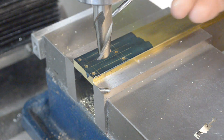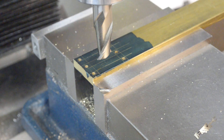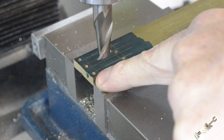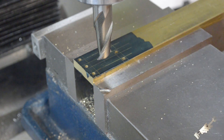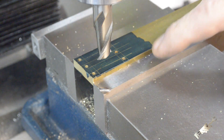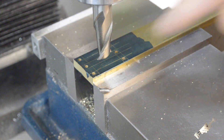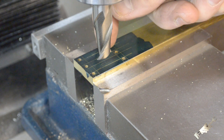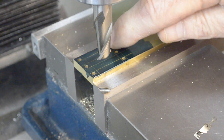I got all the holes drilled. Now I've got a half-inch end mill in here. I came in half an inch — that's going to be a quarter of an inch for the boss plus half the diameter of the cutter. We're going to go down 5/64ths of an inch, which is 78 thousandths. I'll just go back and forth in the Y direction, hogging that out until I get down, then move it over and come to this other line here.